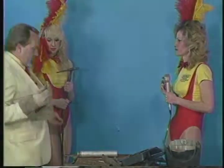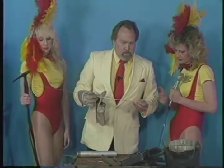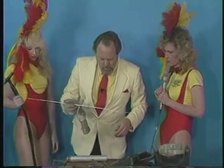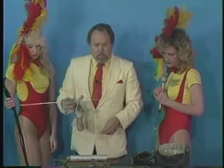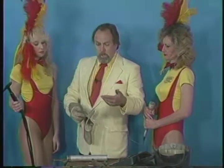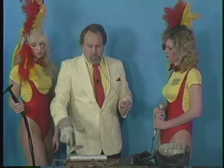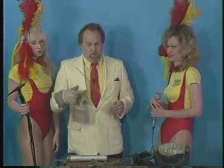And again, I'll throw in another little tip for the experienced welders out there, something they might not know: the rod that I use, you have to select the right one. You have to ask at the welding store when you buy it. This particular brand comes out flat like that. The important thing is that I always want to be able to anodize. One of these days we're going to show anodizing, what that is and how it's done. But if you want to anodize it afterwards and you don't use the right rod, the weld will come out black. So it's important.